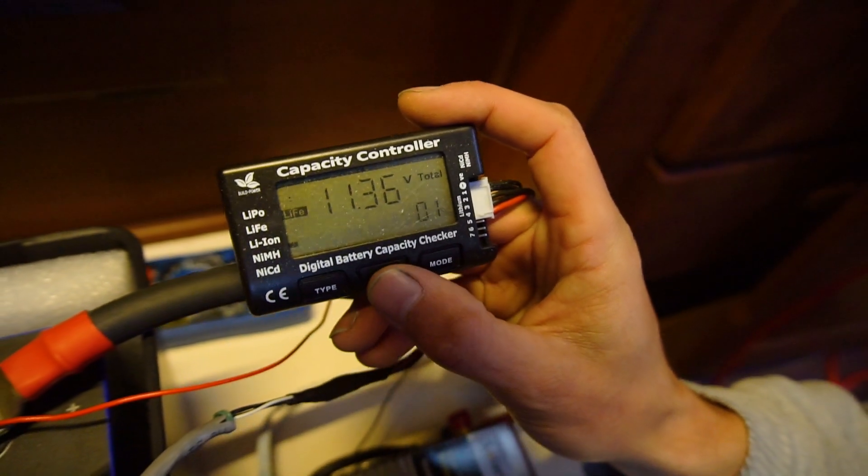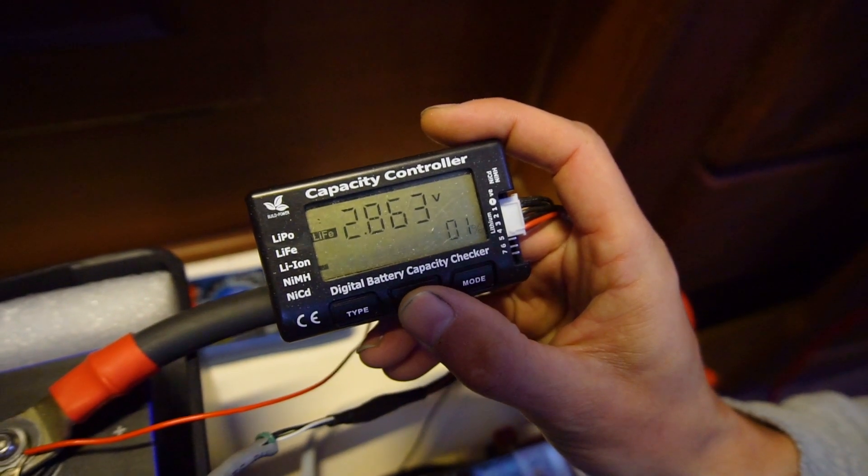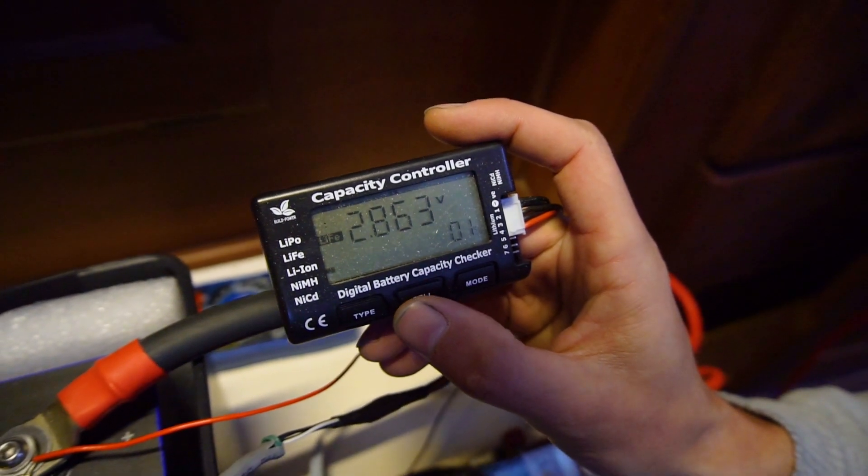We got our 280 amp-hours — full capacity — so we're not going to bother testing the low-voltage disconnect since we're not planning on using it and I'm assuming it's working. I don't want to push the batteries that low just to see if there are an extra 5 amp-hours. Total voltage is 11.36V — cells reading 2.88, 2.89, 2.72, and 2.86 — so they're doing a pretty good job keeping balance. We're going to slap the charger back on just to get it back up to at least 50% so it's not sitting at this low discharge. Hopefully we'll never discharge it this low again — if we can keep it between 20% and 80% we'll gain many more cycles. Really happy with the battery, going to leave a good review.